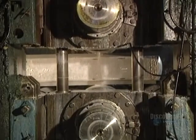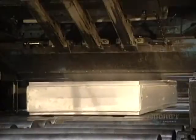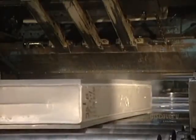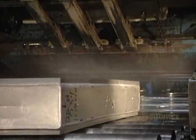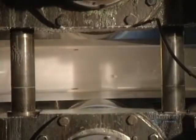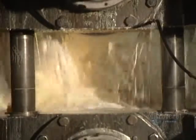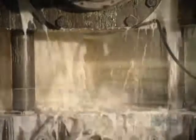Temperatures in the rollers are between 455 and 540 degrees centigrade. Pressure on the ingot is continually verified by a technician. If too great, it's lowered and the technician then adjusts the pressure. The heat is so high that the ingot risks sticking to the mill's roller. To prevent this, everything is cooled with a liquid that's 95% water and 5% oil.